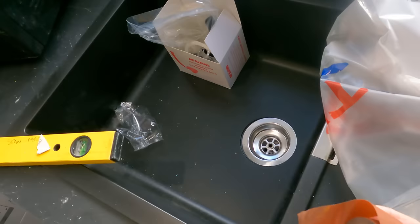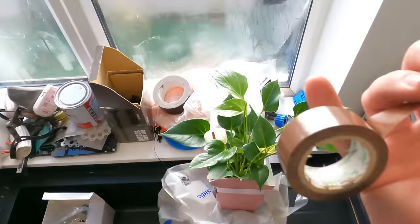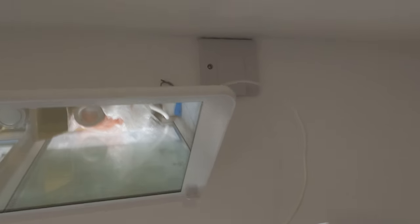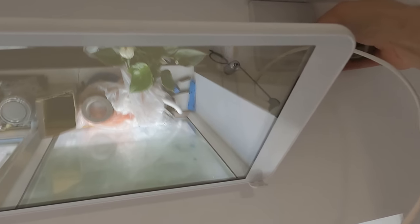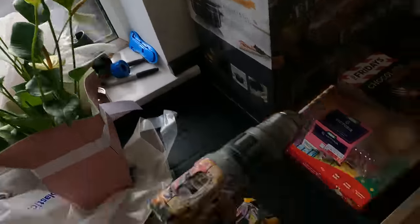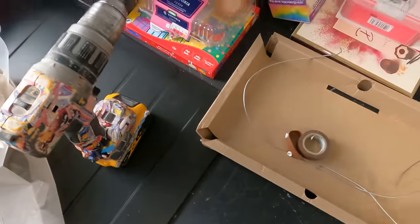Or do I have top tip number 22.7 million? Yes I do. Tape - why do I use tape? Well I've always got tape. Grab your tape, stick it in there like that, get it on the little lug, whip it out. Let me just get the other one out first. Whip it out like that and there they are - you're not going to drop them, you're not going to lose them. You can just throw that there on the side and when you're finished they're nicely in position for you. How's that for a top tip? Obviously people say blue tack and all that, but how many electricians are carrying blue tack around? Not had that since I was in year four.